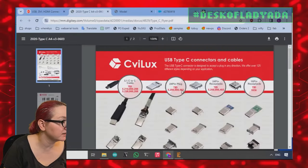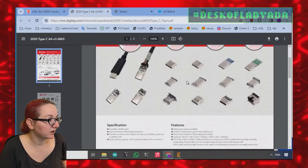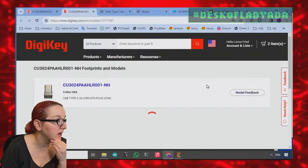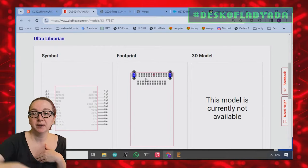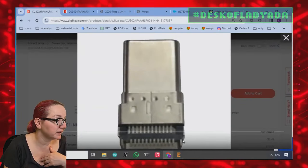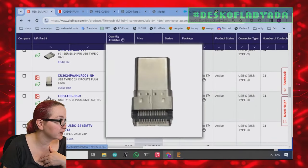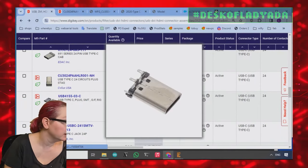This one is the first that is not a straddle mount, but they don't have the proper full datasheet. Let's see if we can look at the EVA module. So this one is actually possible because it has all the surface mount pads on the top and then it has two through-hole slots. This one would actually be okay. You can see here's the slot and then the two surface mount rows. I don't need two rows though, so I'm going to keep looking. This one is similar — two rows of surface mount and then a slot. This one would be pretty good.